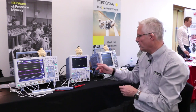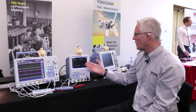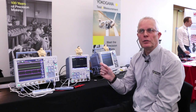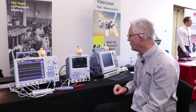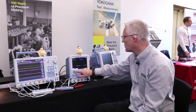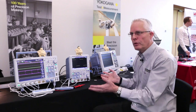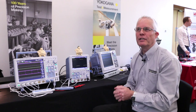We weren't quite certain what it was. We hit stop. Notice how this history light has come on. If I now press that button, you can see it's memorised all those faults that just flashed through. We haven't done anything special to set the scope up — we've pulled up history mode. We can see individual waveforms, look at one waveform, search for them. They're time stamped. It's a very powerful facility, standard within all our scopes. You don't have to turn it on — it's there running in the background all of the time.